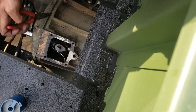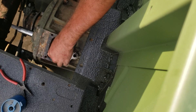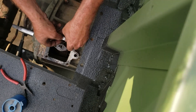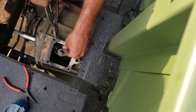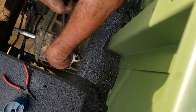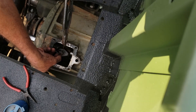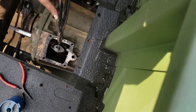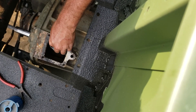The other one was on there this same kind of way, so I guess if it's been together as long as it has it's okay. So now we'll come around this side of the fastener and bring our wires back together. They don't have to be the same length on this side, but you want to clamp your pliers closer to where you intend to terminate it and make sure the wires stay together — if they separate you won't get the twist right. Hold your finger there because that wire is going to want to go that way. Tighten it, tighten it, tighten it again. You see what it leaves — a pigtail, and that is nice and tight. That's the way it's supposed to be. It won't even move.